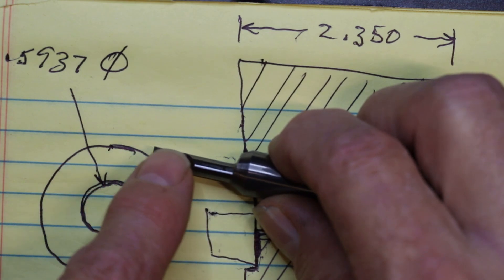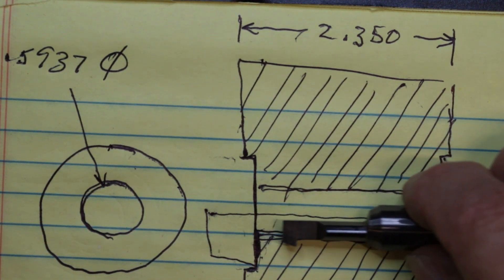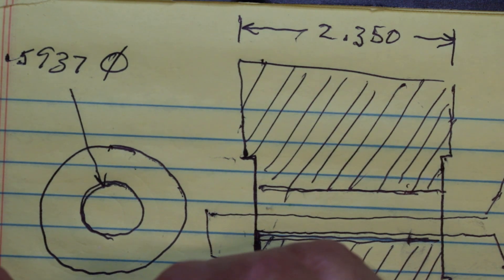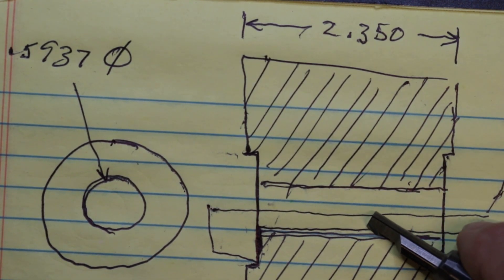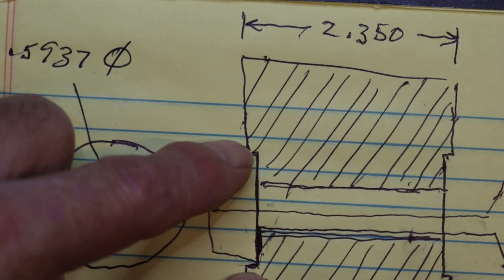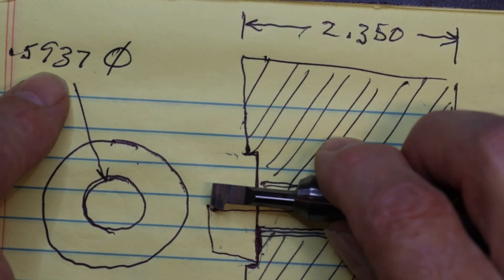This tool still had enough strength, and this is quite a long distance — 2.350 wide on that wider boss with the spot faces. There might not be enough strength in the tool in the middle to do it. I might try it, but I think it's going to give me chattering problems. I'll show you a design on the computer I've worked out, and you'll see how thin this has to be. Even though this would be my first choice if I could do it, I'm not sure if it's going to work or not.